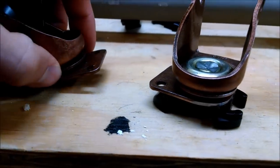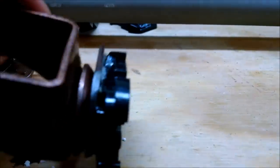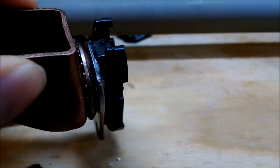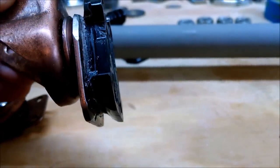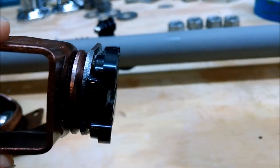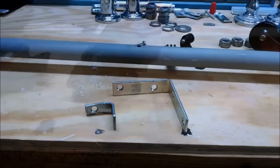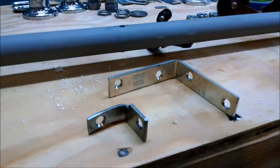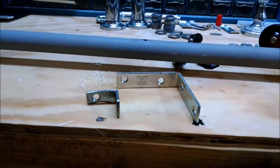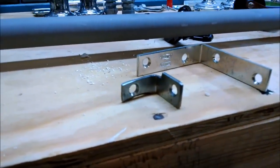You can see how we've shaved this square base plate down, and then just used some metal and plastic epoxy to epoxy it to the top of the GoPro portion. I had to sand a little bit in the groove so it fit nicely on the curved mount for the helmet. We decided to make the stopper piece so the PVC pipe couldn't go super high or super low — some of our original testing showed the camera angle just didn't look good when it went really high up.